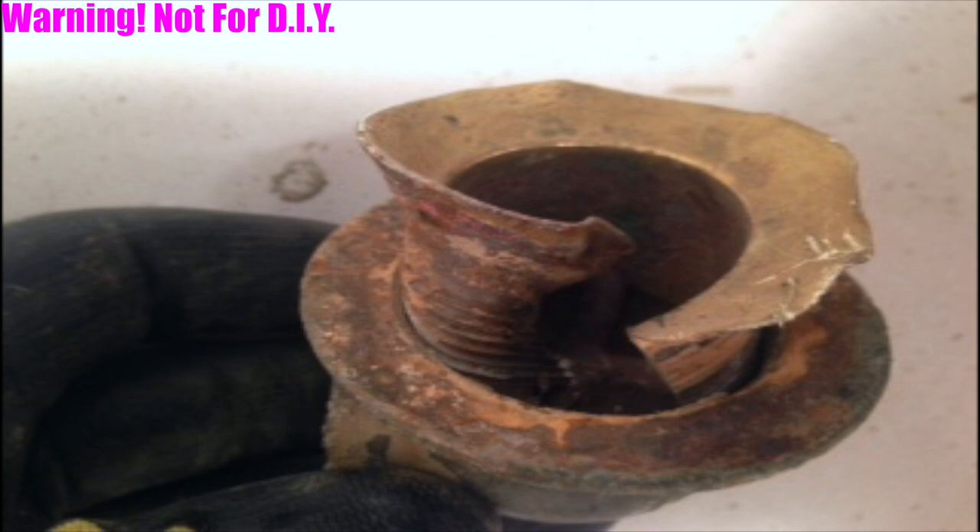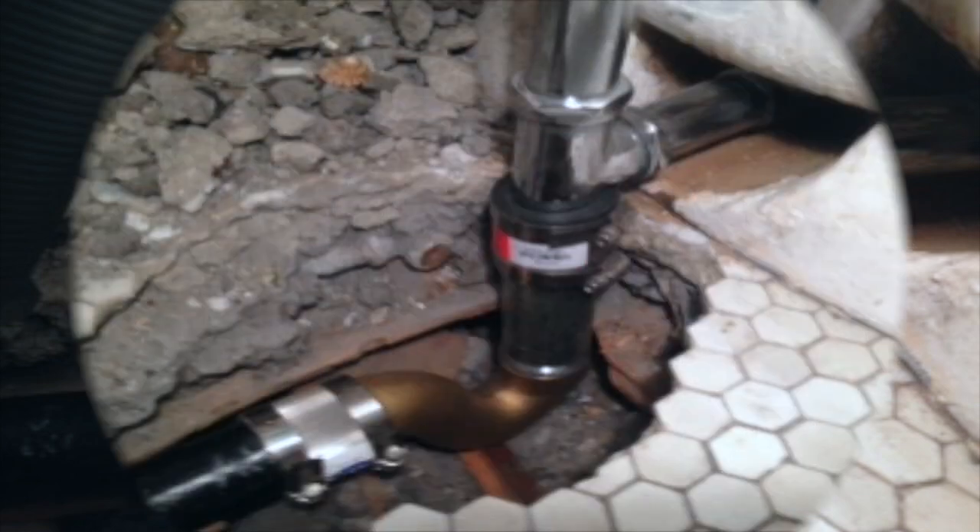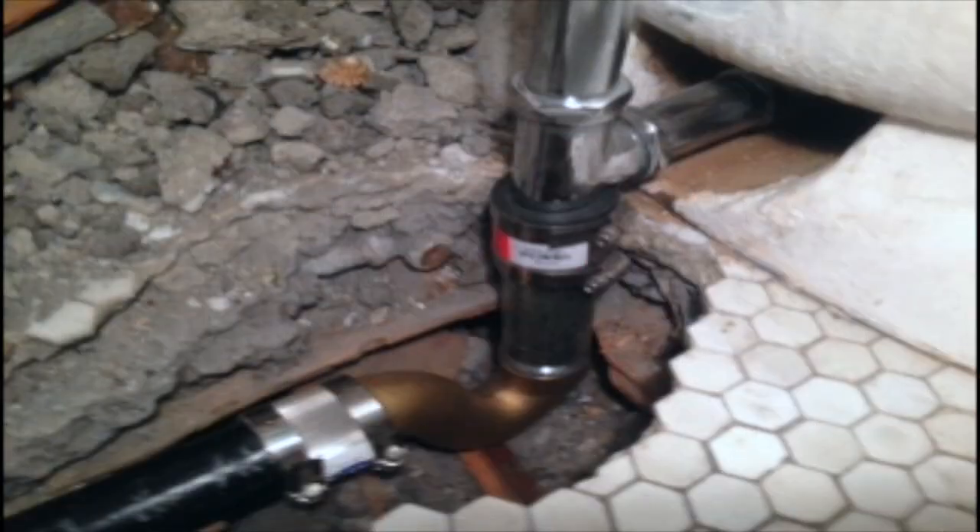In this particular home, it was a six-family — I could not replace it with PVC, I had to use cast iron. So I clamped onto the existing solder nipple. There was about two inches of usable brass, and I clamped my no-hub cast iron drain line right onto that ferrule. Then I ran it across — I have a low-sealed bath trap, a brass bath trap coming up as a galvanized nipple, followed by a specialty no-hub clamp which goes from inch-and-a-half steel or cast iron to inch-and-a-quarter K copper. I inserted the T right into it, took care of the tub drain and the overflow. I put my cast iron directly onto the trap, eliminating a nipple because I don't like to put galvanized into brass if I don't have to. I was able to marry those two with an inch-and-a-half no-hub coupling — it worked out real well.